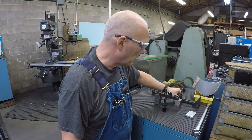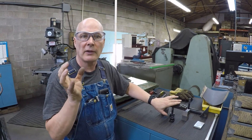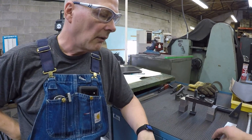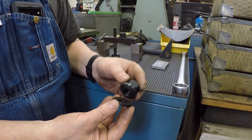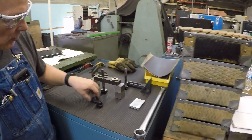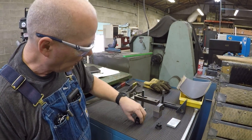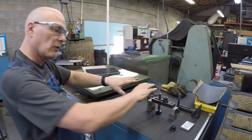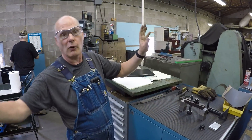What you can do if you can't get these particularly level or you want to stabilize the holding process — you buy nuts and washers like these. Look at that — it's got a concave and convex surface that dish together. What happens when you put this on instead of a traditional nut: even if the clamp is at a slight angle, you get a straight pull on the bolt, so you're not pulling your part and adding distortion you don't want.